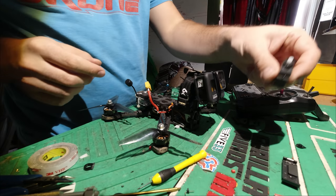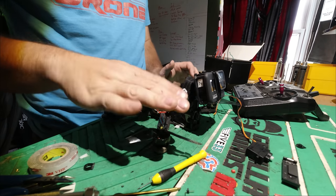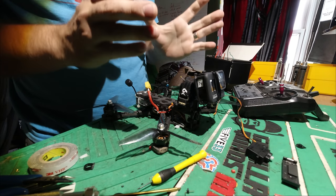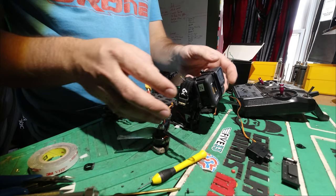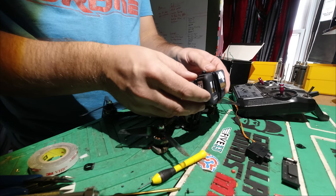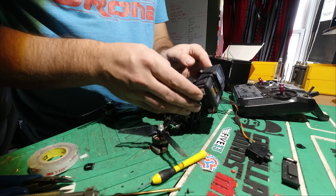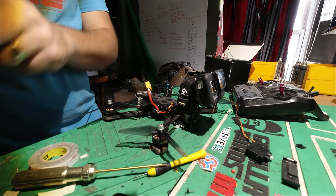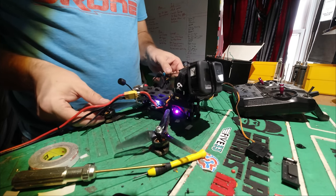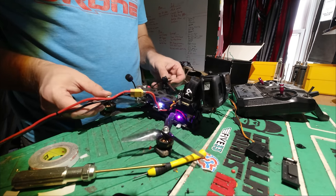Originally I had both servos installed, and I actually managed to get the cam stab tilt thing working on two axes, right? So it would pitch it and it would roll it. I wanted to take an incremental step here and just test on the roll axis. So I've mounted this little servo gimbal on just the roll axis. It's a little bit wobbly and it's not going to be a great perfect solution long term. But now when I plug this in, hold drone, servo activates. And now when I roll, the gimbal counteracts the roll movement and stays relatively level.